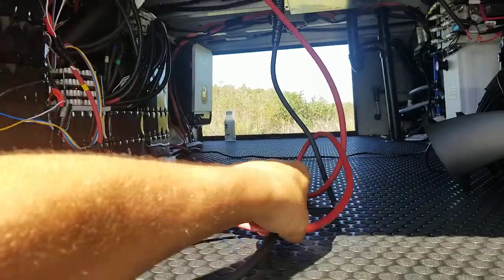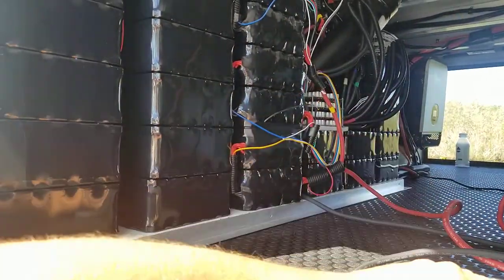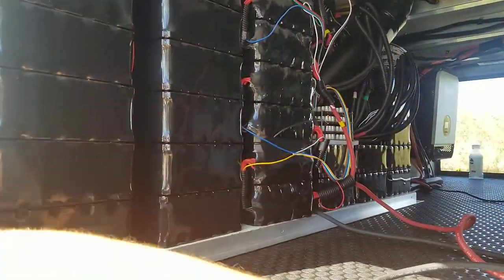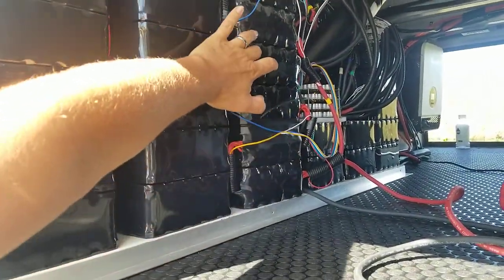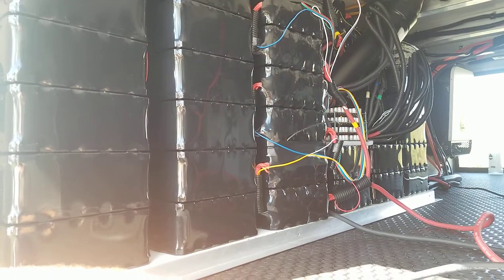You will see that I have these big cables out here because I'm going to take this 12 volt battery section here, and I'm going to remove it to show the back end area where all the cables are. That's the reason for it, it's designed to be removed and worked on. It's part of the 48 volt section, because that 12 volt battery section, you can actually count the 8 segments there. Each is lithium iron phosphate cells.